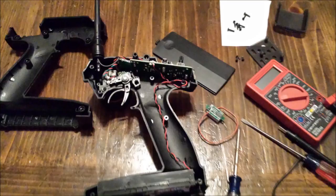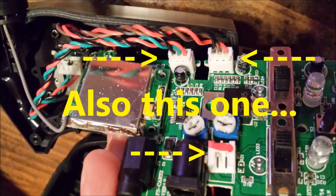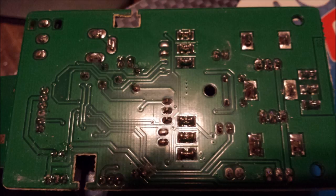First thing you want to do is take apart your transmitter. There are just a few screws that hold it together, and once you have those apart it looks like this. This is the bottom of the board that we're going to be soldering to. The two quick connects on top you can remove if you want, but you probably don't have to — it'll just make it easier to deal with fewer wires. The two points we're connecting to are the ground and the positive.